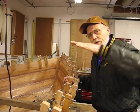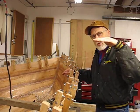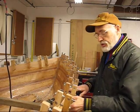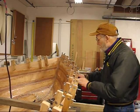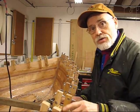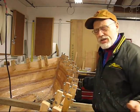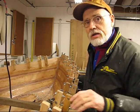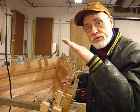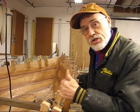It's stiffer, so you're not going to get a whole lot of variation. When you put it in, starting at one end and going to the other, it's going to maintain somewhat of the right height. Go ahead and bring it up to the upper surface of the plywood and then go along and feel — you don't want the outside rail higher than the plywood, because then you'd have to take down the rail to match it. Otherwise you'll get a little depression in between the inner and outer. You want the plywood to stand slightly proud.